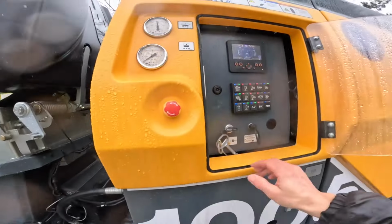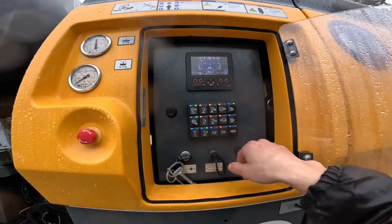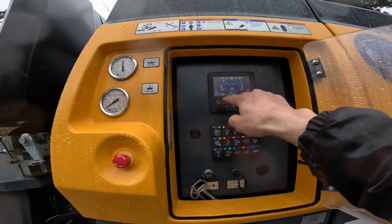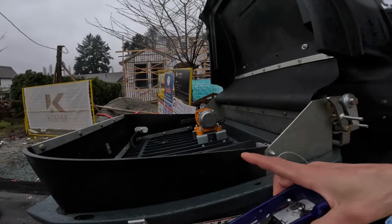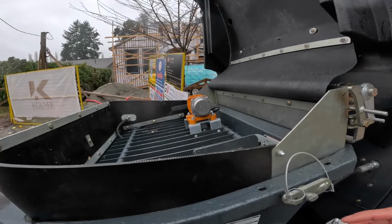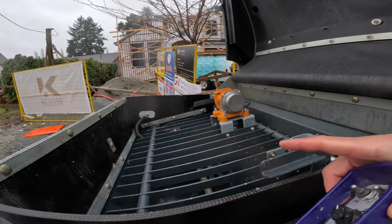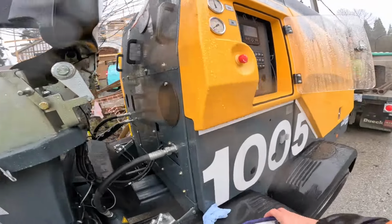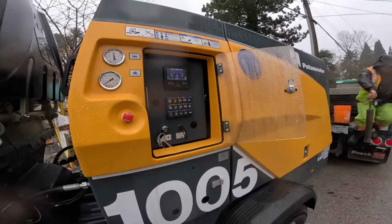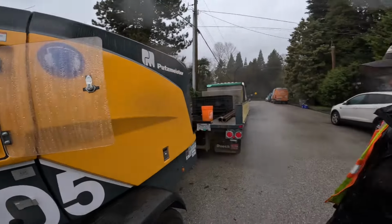Very, very easy. So we're going to plant our outrigger legs here. And it seems to run on for about 3 seconds after you shut the pump off too, which is actually pretty handy, because if your hopper is real low, you stop the pump, the vibrator keeps running a little bit, so at least the mixer guy can shake that last little bit of stuff out of his chute. So I don't know if it's engineered in that way or if that's just the way it worked out, but Ian, let's drop some outriggers down. Just do it. Let's do it.